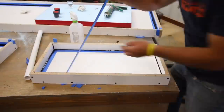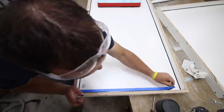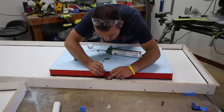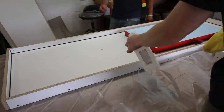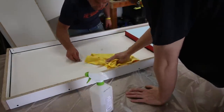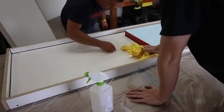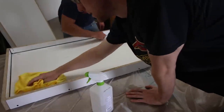Make sure to have a garbage can nearby for all the excess tape. I used some silicone to attach the sink knockouts to the mold and put some tape over the knockouts to prevent concrete from getting in them. Do a final cleaning of the mold before the concrete is poured — use a razor blade to remove any dried silicone and some rubbing alcohol and a rag to get rid of anything else. You'll want to let the silicone cure for a couple of hours or until it's firm before mixing and pouring any concrete.